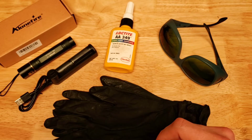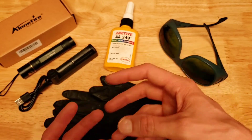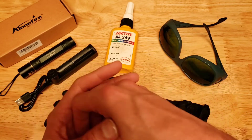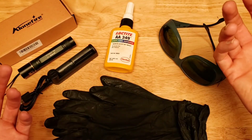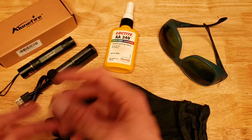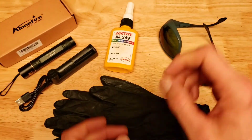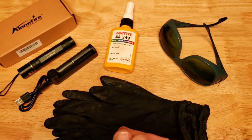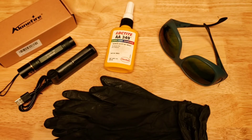Sometimes a fluorescent UV or arc-type UV lamp with a much wider spectrum will do a better job of curing those wavelengths. But those lamps are very expensive, bulky, and fragile. This flashlight works fine — I just dunk the parts in water, or put a light coating of water over them, cure them, then clean and dry them off.